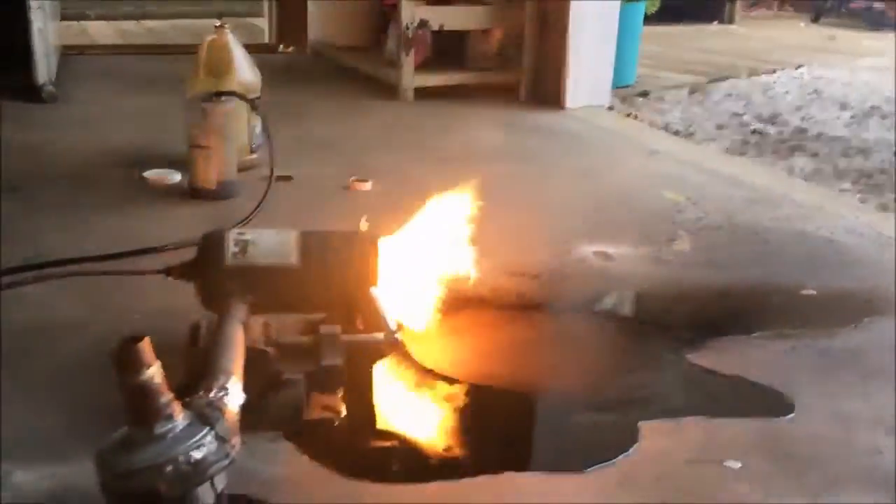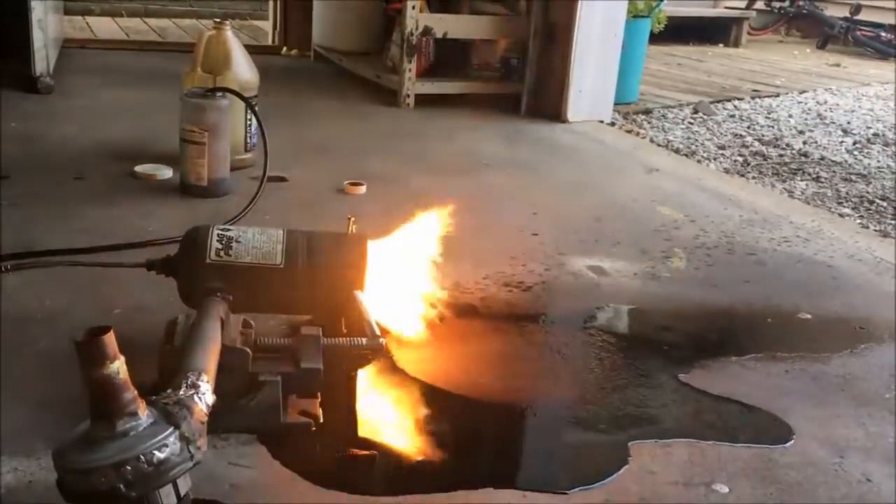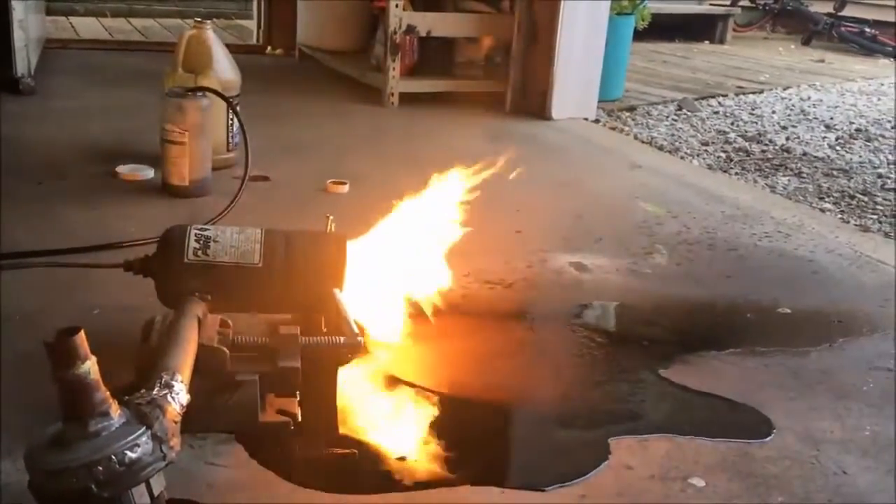Not to mention that most oil nozzles will be clogged up by waste oil. You can't use an atomizing nozzle on most waste oils even after they're filtered, because of the hairy fibers that still end up getting through somehow.